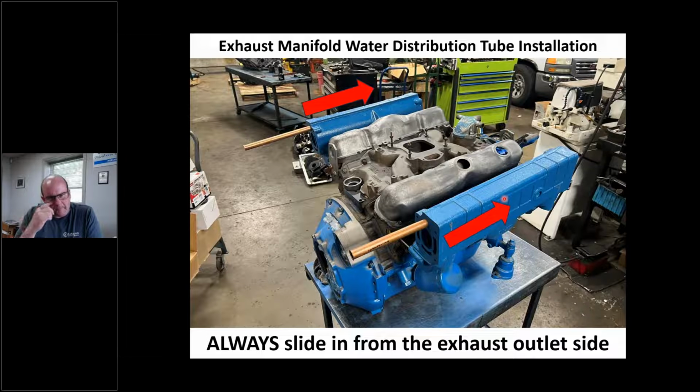And here's the other thing, which we're getting to: I can have impeller blades stuck in here. That's why it's so important for the installer, or you, if you do everything like me, to take this stuff apart. If this stuff is 30 years old, 40, 50, it could have blown impellers 25 years ago. There could be little itty bitty blades stuck in here. I've seen blades stuck in elbows.